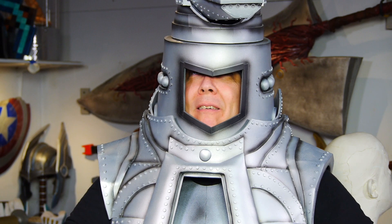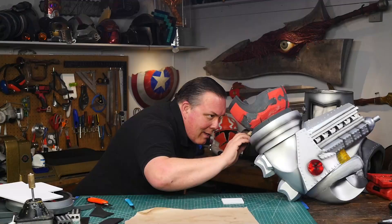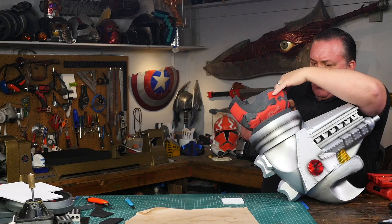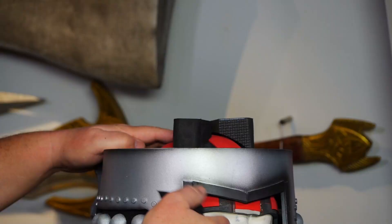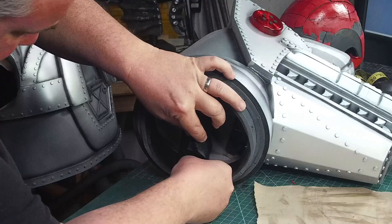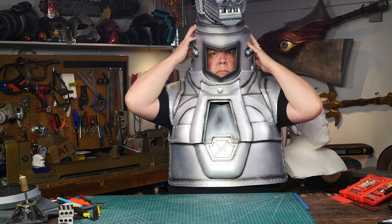How do I measure that while I'm wearing it? This may not be something I can do without an assistant. So my solution? Don't measure it. First I add a ring to fit the inside of the Lazy Susan and bring the head down to meet the red helmet. Then I mark approximately where I think the two parts are going to be fitting together. I use some foam core to figure out the curves on the helmet and then trace them onto some really thick kneeling pad foam. I cut the thick foam with a band saw and got wedge shapes that will connect the top of the helmet to the inside of the head ring. I use contact cement to glue some hook-side velcro onto each wedge, then cover the top of the helmet with the soft loop side, and line the inside of the head ring with more soft loop velcro. The head is actually supported by the neck and shoulders of the costume, so this velcro connection is only to help me turn the head and I can adjust the fit as needed whenever I wear it.